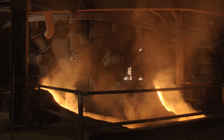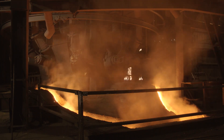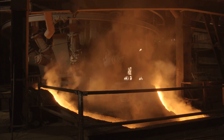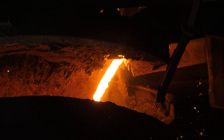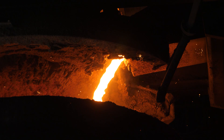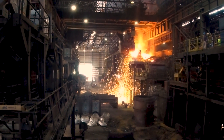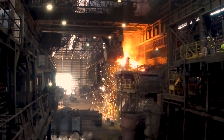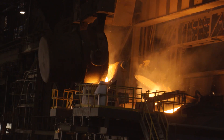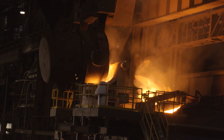The materials in the cupola are heated to more than 2,500 degrees Fahrenheit, liquefying them. The metal melts while traveling down the 70-foot stack, and flows out the base of the cupola into a 50-ton ladle, which is then poured into one of two holding furnaces. These furnaces add consistency to our metal chemistry and support our 24/7 production.